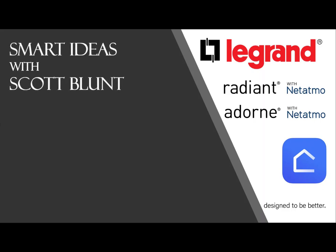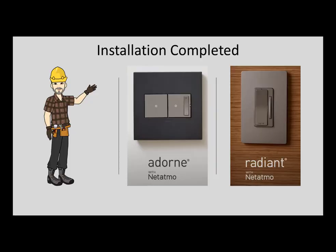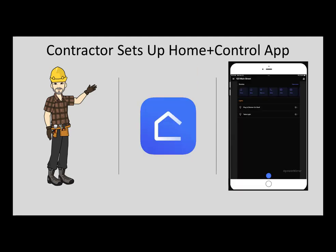In this video, I'm going to show you how, as a contractor, you can hand off the system to the homeowner. First, get the system installed as normal. Wire up your lighting controls and any outlets that are involved in the system. Then, using the gateway in the Home Plus Control app, you can connect all the devices to the Zigbee network, set up rooms, name devices, set up three-ways.